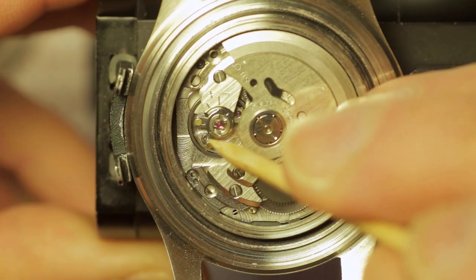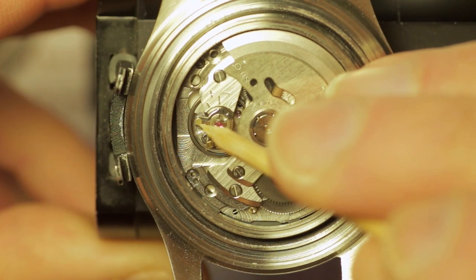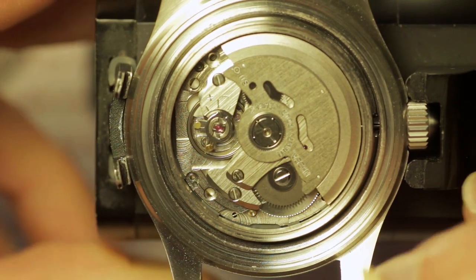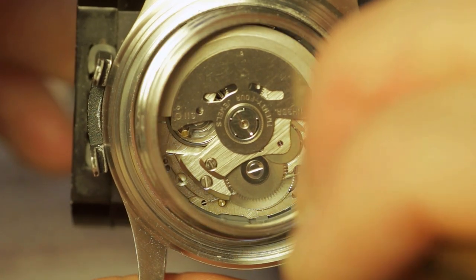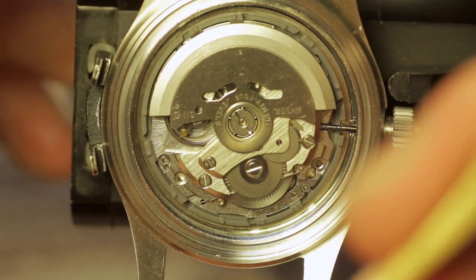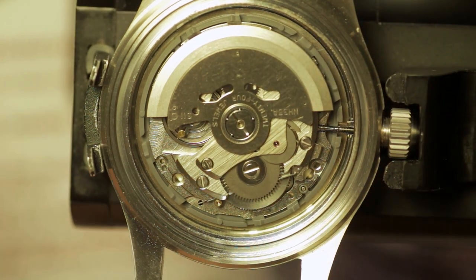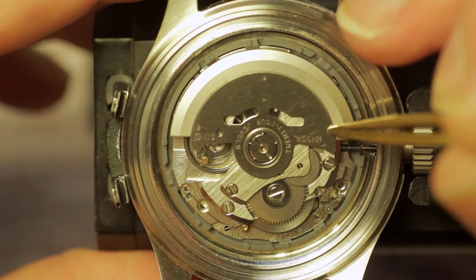It should go without saying, movement of these should be done very slowly, very carefully, and up close with magnification, because it's very, very easy to poke something into that fragile little hairspring in there. What I'm going to do here additionally is take out the movement ring. It's a very nice milled aluminium, it looks like, movement ring. Just give me a little bit better and clearer access.